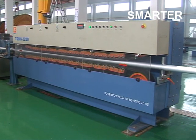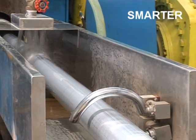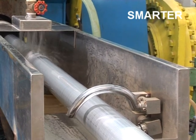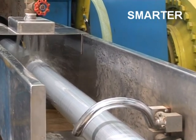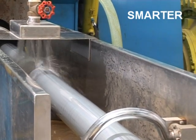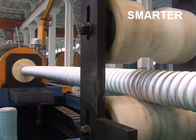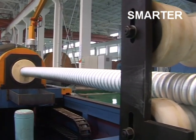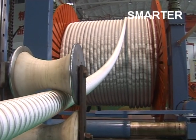When making aluminum cladding cable, the cable passes through a water cooling protection cover and the central hole of the extruding die core to make the extruded aluminum clad on the cable. It is then cooled by water immediately so that the cable inside the tube would not be burnt. The aluminum tube is then made into spiral or annular metal corrugating through the corrugating machine and then coiled onto a drum.